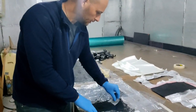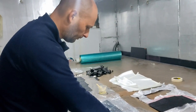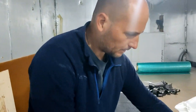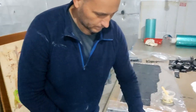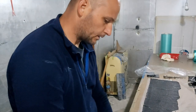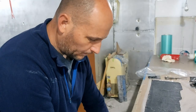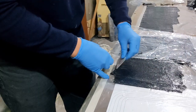It was a method that was used a lot before prepreg became the staple method for building race boats back in New Zealand. So we used to have big wet out bath machines so that we could actually wet out literally rolls and rolls and rolls of carbon. We'd take those rolls of wetted out carbon to the boat and roll them out on the boat, on the job. So we knew that the fibre had the correct fibre to resin ratios before it actually went on the job.